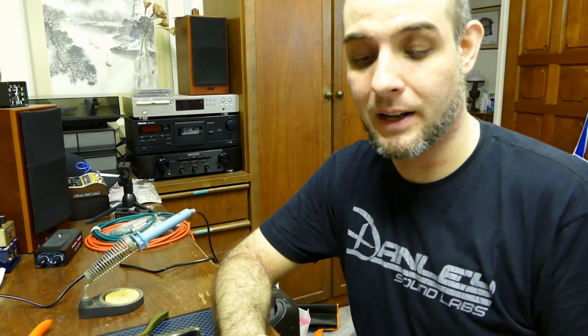That's how you wire 13 amp plugs and sockets. One thing I didn't mention in the video was whether to use Loctite on the terminal screws. I did for many years, but then I had an incident where the Loctite reacted with the plastic of some brand of socket I was using and caused it to disintegrate — not this brand, some other brand. Since then I've stopped using Loctite inside my AC plugs and sockets. I find that as long as you use the two-stage tightening method — hand tight, wait a minute, tighten again — I've never had any of these terminal screws come undone. The tinning also really helps because it increases resistance during the final tightening due to the way the solder binds the individual wires together.